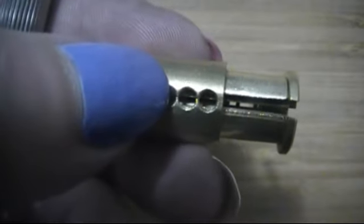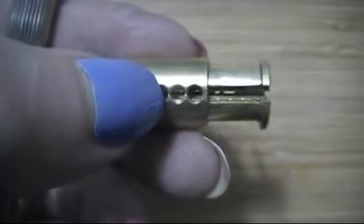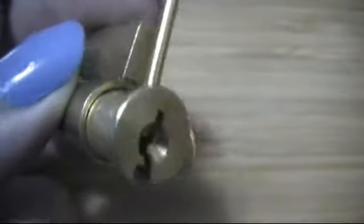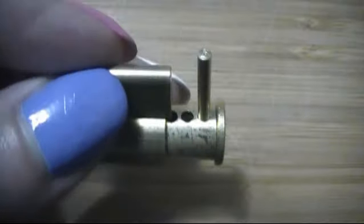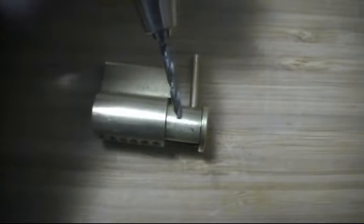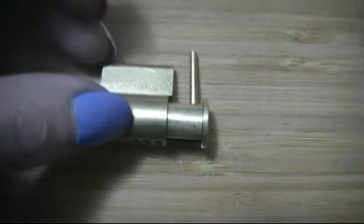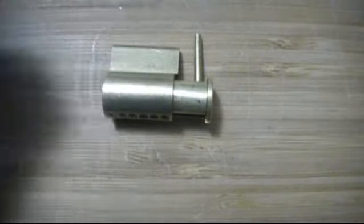As long as it's between two of these holes, it'll be under this bar, or this bar, when you turn the core, and then it can't fall out. Now, I believe you could cleverly put it at the right place on the clock face that it never goes under there under normal operation, but fuck that, I'm going to do it the easy way. So that's important, is to not drill it in line with any other holes, so that it doesn't fall out. So anyway, I'll be back when I've got some progress on that to show you.